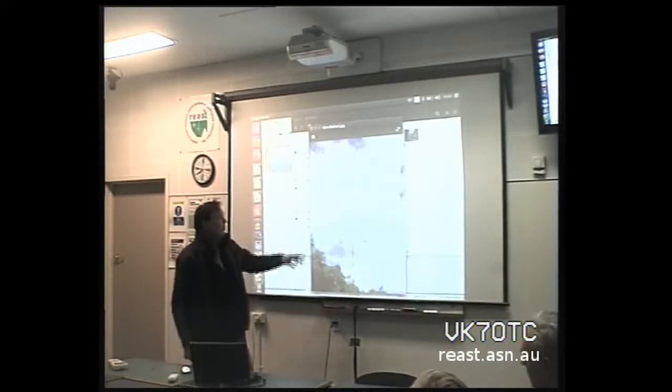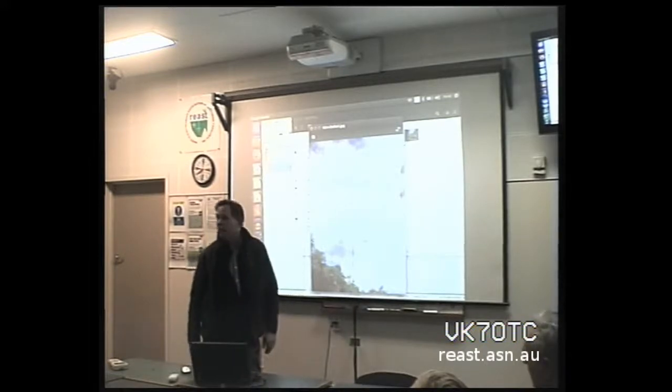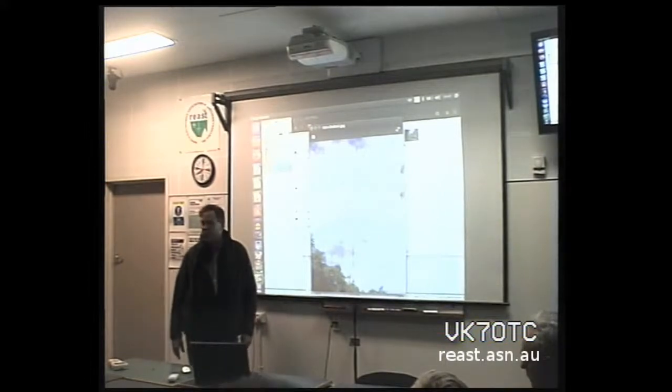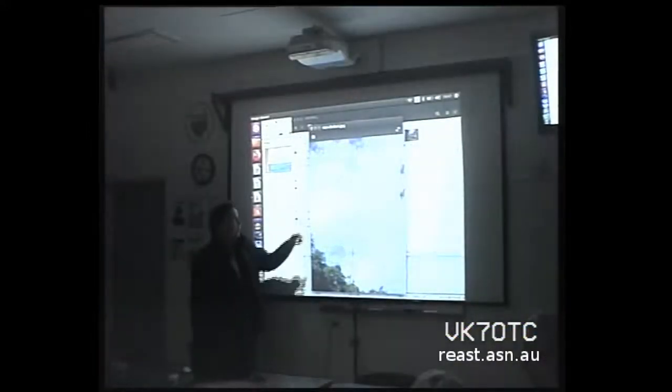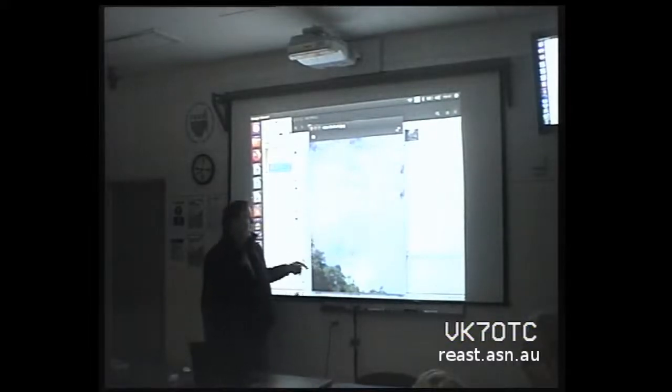and what I have here, how many people know about 40 meter delta loops? I can't talk too authoritatively about it, even though I have one up, but it's 11 meter at the apex and 17 meters at either side, and then that horizontal is suspended 2 meters off the ground there.